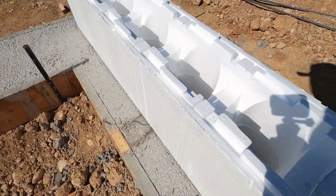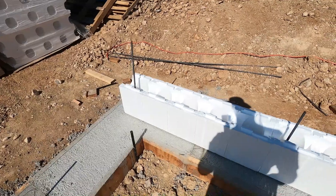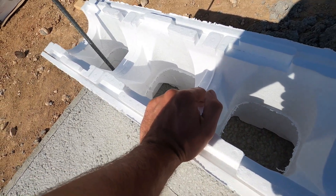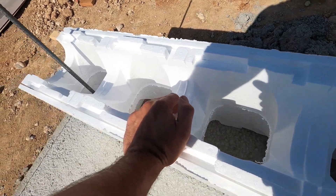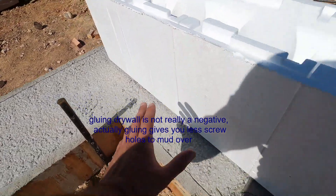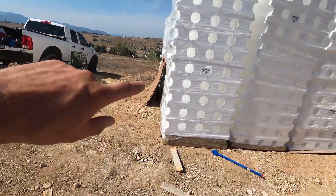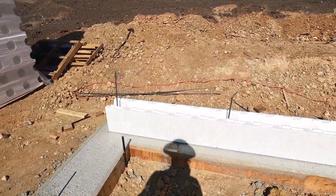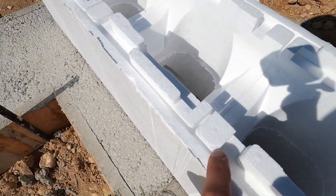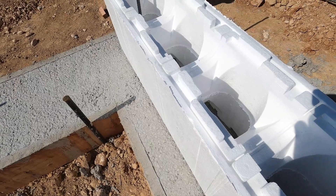This one's got a thick core of foam, so it uses way less concrete because of the large amounts of foam in here. If you were to build this wall up about three feet tall with these foam blocks, pour it with concrete, and then melt off the foam, it would be a waffle pattern because of the cores. They were engineered to be solid and structural, so we're not worried about that. The only negative is if you're putting sheetrock in the basement right to it, you'll have to glue it. I also have boards piled up that I need to rip down into one-and-a-half-inch strips to lock into the grooves, so there will be material to screw to later on.